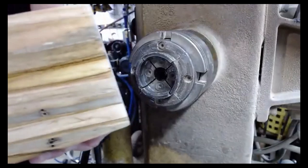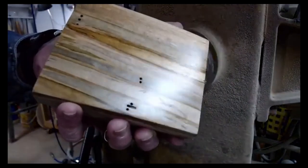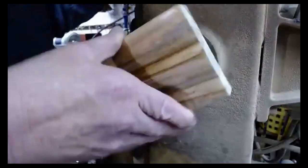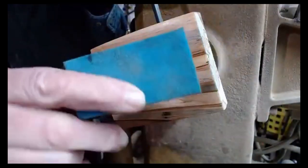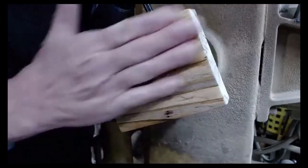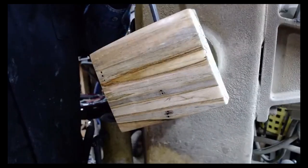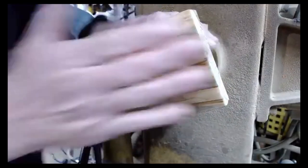So Tom Pennington's got a question. He says, does he let it dry before sanding or wet sanding? I'm not quite sure what he's referring to. Yes. Well, no, this paper, it was still wet. So I put the sealer on there, my MQF, and then while it was still wet, I wet sanded it in with this 800 grit foam back paper. So I sanded it all in until it feels nice and evenly sanded. I didn't miss any areas. I think that helps the work. It definitely works it into the top of the wood grain. So you wet sand that in with this foam back paper while it's still wet. Then after you're done, dry it off with a paper towel. I just lightly dried it off, and then that's step two.